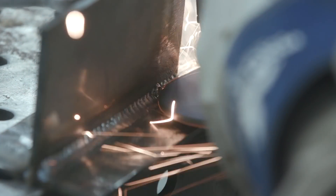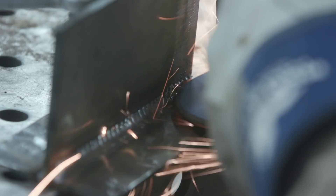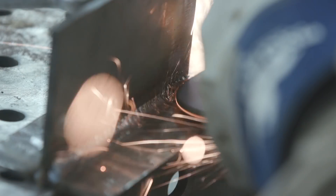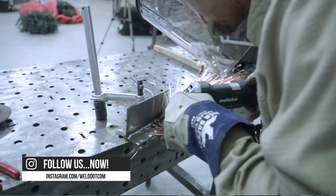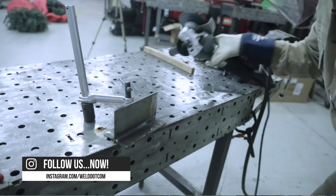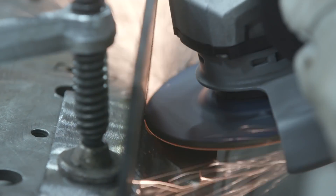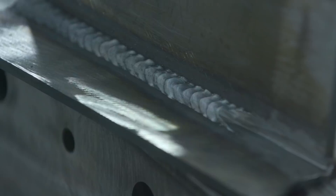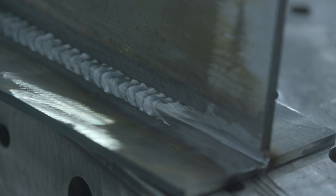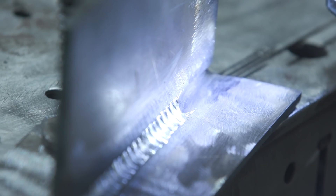Be cautious of the base metal when you're outside of your weld joint — don't grind into the base metal where you can see it visually. On a critical weld, if you get base metal reduction, BMR, they'll flag you and a whole bunch of repairs and griping will follow. Keep grinding your weld and porosity all the way until you don't see one speck. I started right off the crater at the good part of the weld.